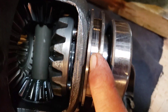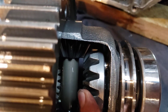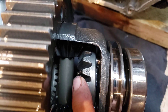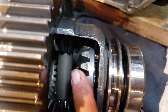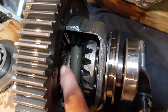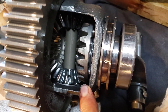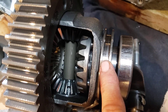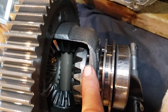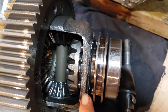Something needs to be done — this is ridiculous, shoddy workmanship. I've got to replace this carrier because, as you can tell, the movement in here has elongated the slots — the holes have become slots. These gears are fine, but they're the most expensive part and you have to buy them as a set for $700 Canadian. The carrier is about $200 Canadian and this collar is just under $100 Canadian. I got a new collar and a new case and I'm going to reuse those gears.